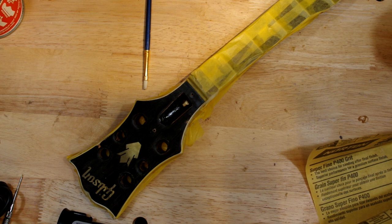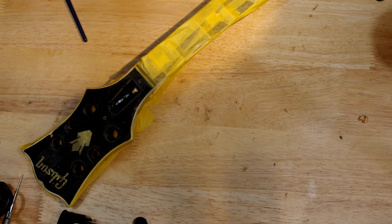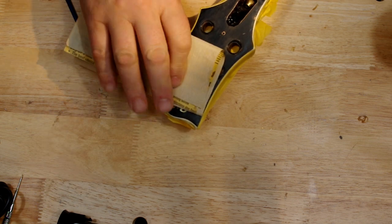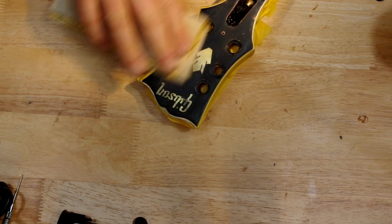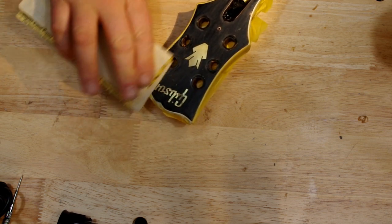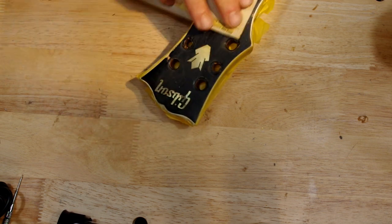So if I have a wet finish sitting on the surface for an extended time, I'm not afraid that I will melt into and destroy my original finish. So I just want to add to it, not take away from it. But because the brush is a little brutal, I guess you could say, it doesn't have as much control as the spray, and you tend to put on quite a bit more than you would with a spray gun or a spray can. Now, because I have the vinyl sealer on there, I will not get a chemical bond.